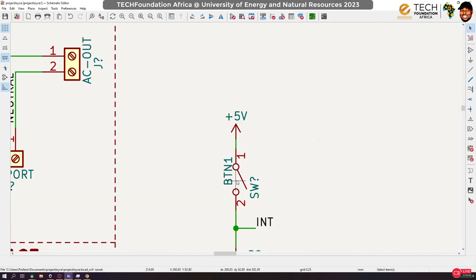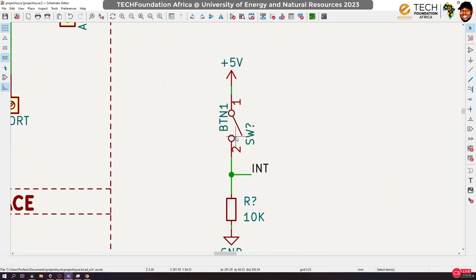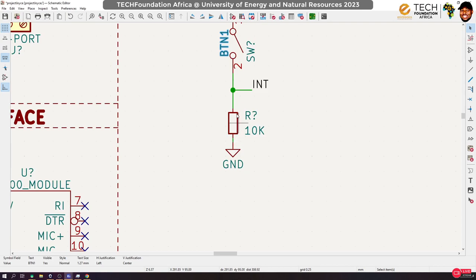Okay, so our switch is here. That means that until we press on this switch, energy does not flow and the current does not flow, right? So this point is always connected to ground. Even though there is a resistor here, there is no current flowing. So all this point will end up being ground. And that will be the default state of the button.